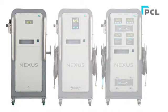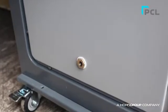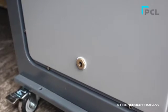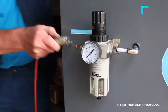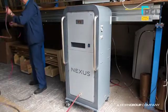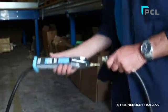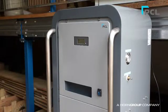For the generator-only unit, follow the same installation procedure. Before starting, you must ensure a hose terminating in a coupling connection is attached to the output port on the front bottom panel of the unit. Then simply connect the power and air supply to the machine and turn the power on. To begin inflating, connect the coupling end to the existing inflation or delivery equipment, such as the Mark III tower inflator, and use as normal. Please note that the display screen shows the internal tank pressure only and is not linked to the inflation device.